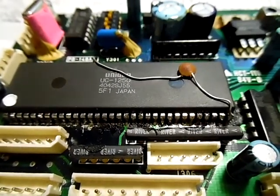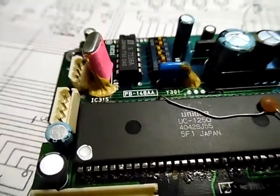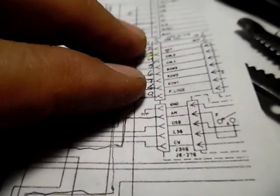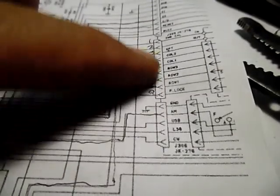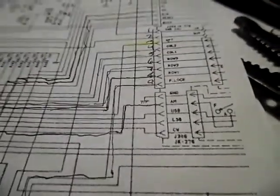I figured if I changed the chip out to the chip from a 2510, this 2600 would allow more frequencies — but it didn't work that way because when I put it in, it didn't show anything on the frequency counter. The 2600 has some differences: it has this crystal, this IC, these DIP switches, and this controls the tone — that's the repeater function, which the 2510 didn't have. Also, these plugs from the face plate aren't in the right places — the pin-outs shifted down one, so the F-lock was a ground, AM wasn't there, and CW, lower sideband, and upper sideband were all shifted up one.